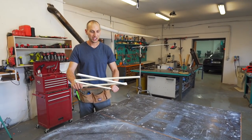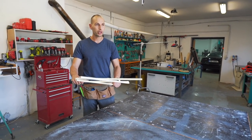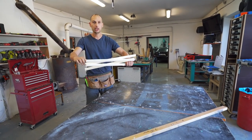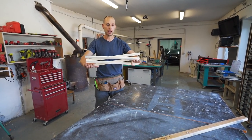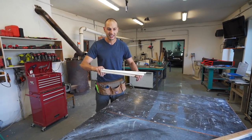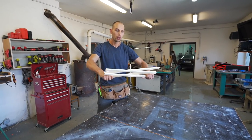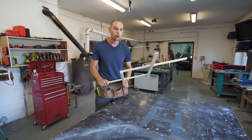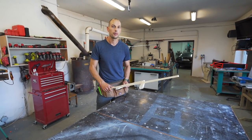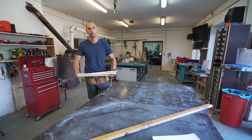I love this mechanism. I wish to be using it. Scissor mechanism is just killer. I'm achieving around 46 degrees angle, which is great. This is my limit because I need to fit it under my solar panel. The roof windows already dictate the layout. And the problem with this is it needs extra supporting material to push against, and that on my layout would cause me around extra 15 kilos. So unfortunately, that would be too heavy for us.